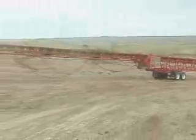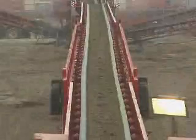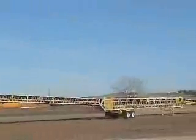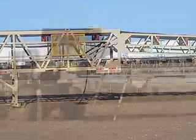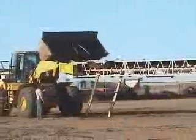The material is conveyed over the entire length of the conveyor and transferred onto another conveyor or any other means of transport. Once you have completed conveying the required amount of material, the teardown is quite simple. Begin the teardown by hooking the loader to the tail end to prevent the section from moving, then remove the safety locking bolts on the tail end section and place them in the transport bin. Also, the electrical cord can be unhooked from the power source.